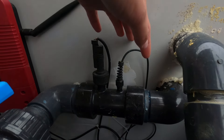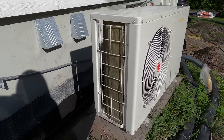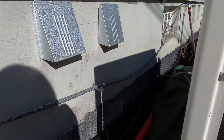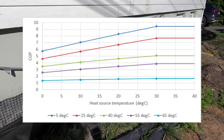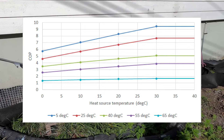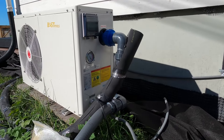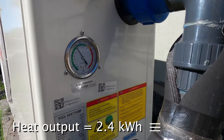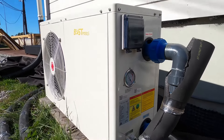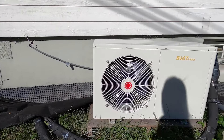After the flow sensor, the water continues past the temperature sensor — also used by the HeatSmart — before going out of the technical room through insulated flex pipes and into our Best Pools 14 kW air-to-water heat pump. The heat pump is strategically placed in front of the exhaust valves from our server room so all excess heat from the servers can be reused to heat the pool, significantly increasing our COP — coefficient of performance. The COP on this pump is 5.8, meaning that under ideal conditions of around 23°C, our heat output with 2.4 kW of electricity would be equivalent to 14 kW of electric heating. This is possible since air-to-water heat pumps extract heat from the air instead of heating water manually.